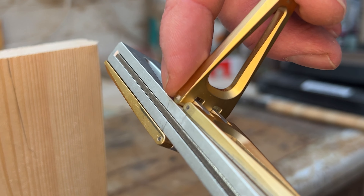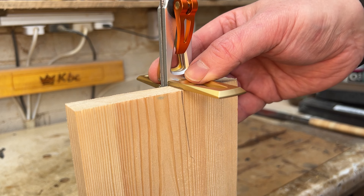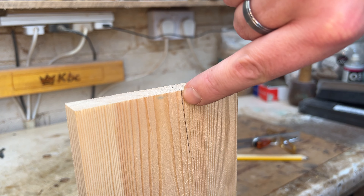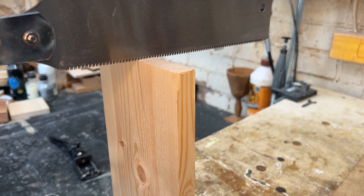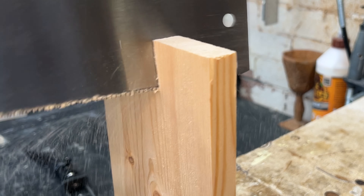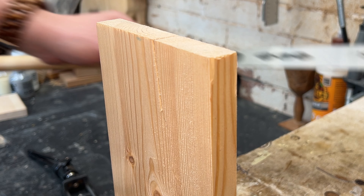You can see where it's been flattened off. That might well be just a manufacturing thing, but I don't see why you couldn't manufacture it with the straight line continuing right to the very end. What I've found with this little kink at the top is that when you use the 90 degree section to mark off the top, by sawing on this side of the pencil line it actually angles perfectly through the center of your pencil line as you cut down it. So if I start my cut just to the side of the pencil line and then angle my saw, it runs pretty perfectly down the center of that pencil line. I can't find any information on whether that's a design feature or a manufacturing defect — leave a comment and tell me which one you think it might be.